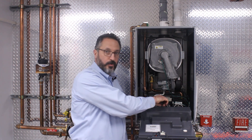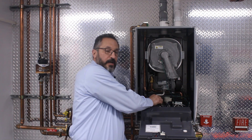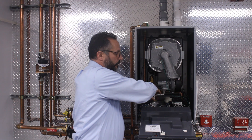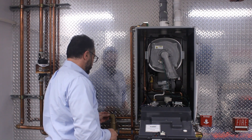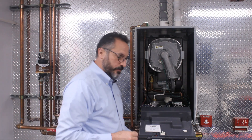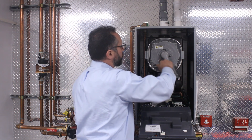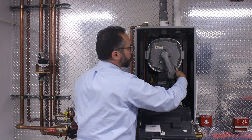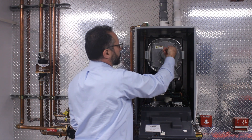To avoid galling the nut, you want to grab it by the corners and just loosen the nut. It doesn't have to be tightened overly tight, just secure. Loosen the nut and slide the gasket out from the gas valve and place it somewhere it will not get lost. Then address the four 10 millimeter nuts on the burner door — loosen these in a star pattern to avoid torquing the burner door. Once they're loose, you can take them off with your fingers.